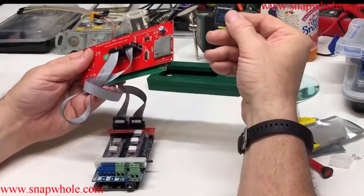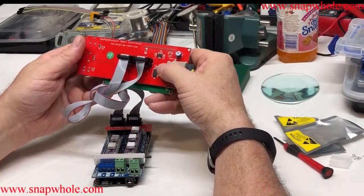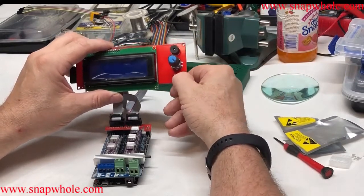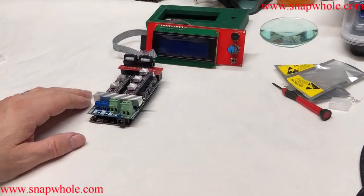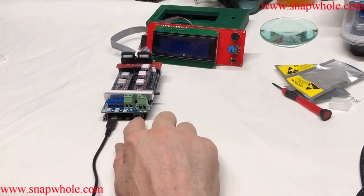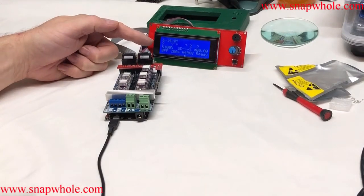It has an SD card slot and I brought an SD card. Don't force it — just find the right orientation and there we go. There is the contrast control, a speaker button — more of a buzzer really — and a stop button. There's a reasonable expectation this will work. I've got all the components, I've already programmed it, and I happen to have a micro USB. For this experiment it will work. There we go — it came up: Marlin 1.19. We have a display.